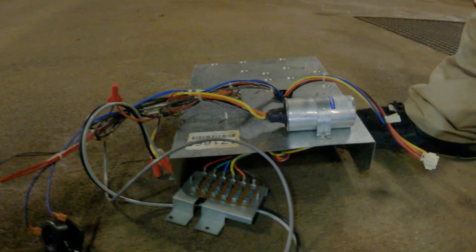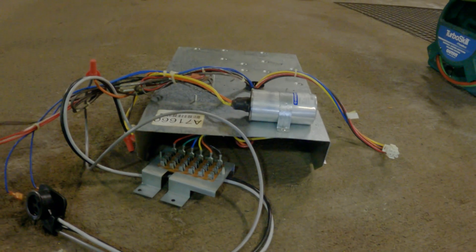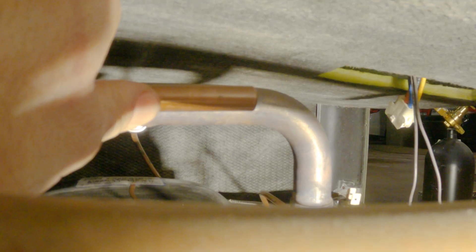While I'm tightening down the compressor, Ricky's going to replace the capacitor. I always replace the capacitor on a compressor changeout, and sometimes even the contactor. He's also going to throw a new compressor plug in. Remount your TXV bulb. Some people might call me a hack for installing the bulb with zip ties, but that's fine — I've never had any issues with it. Just make sure you don't use cheap zip ties and use a bunch of them. Since the TXV bulb is not in the air handler part where the fan is, I am going to insulate it. Hook our reversing valve back up.